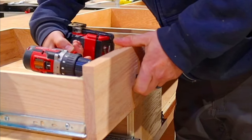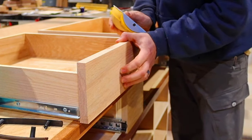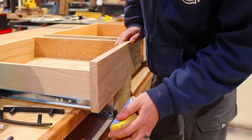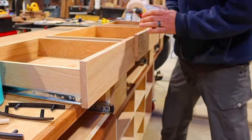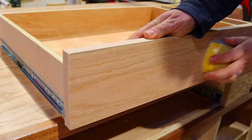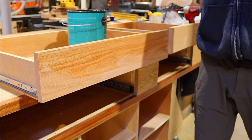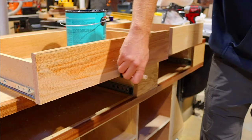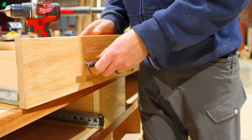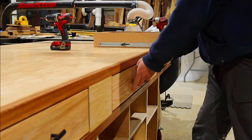Last but not least, we want to dress up the front of these drawers so they're protected as well. We take the handles off that we've already put on — the screws are holding the front on so we don't need them anymore. I take some 120 grit on a sanding block and ease the edges of the drawers and screw holes. You don't really have to go higher than that; this is shop furniture. I ease those edges, then put two coats of polycrylic on the front of the drawer fronts. I reinstall the handles, put the drawers back in place, and now it's time to start loading the drawers because this table is done.